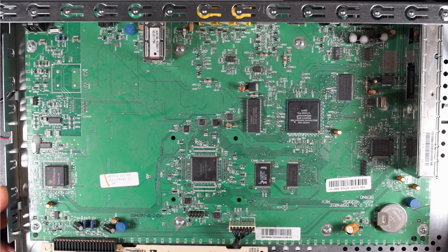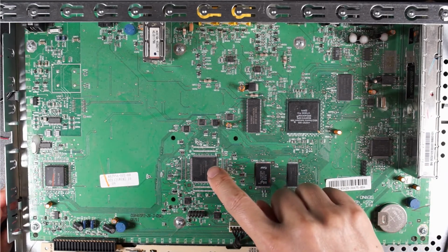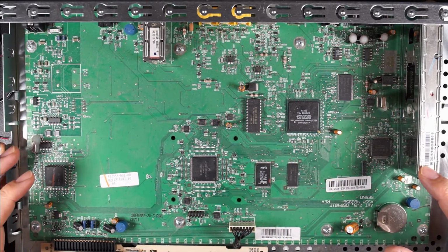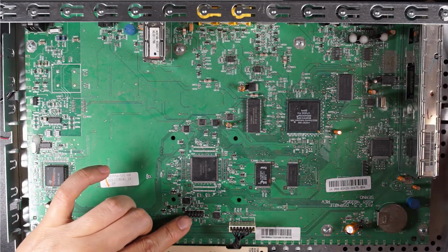This is a DSR405 satellite box. It uses an MC68331 CPU, and the protocol to talk to this also uses the BDM. And this is the BDM port. On the lower left side, it's pin 1.